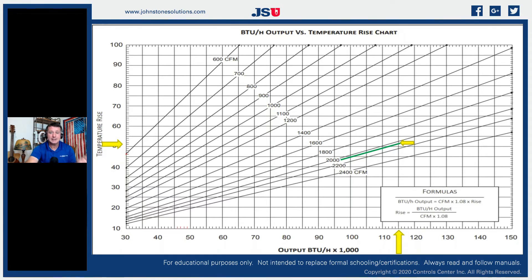I can go to the furnace and select a speed tap that will produce slightly above 2,000 CFM. A five-ton drive will push 2,000 CFM and higher. Some of the new variable speed furnaces have five-ton drives that can push almost 2,200 CFM with proper static — at 0.5 inches or less static, we can move a lot of airflow. All I really need to do is find my BTU output, find my temperature rise, select the CFM needed, and I'll hit that temperature rise without constantly making adjustments. With our new variable speed equipment we can fine-tune CFM very precisely, which means we can fine-tune our temperature rise very easily.